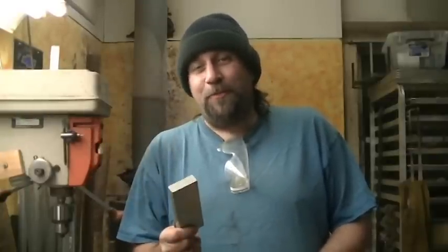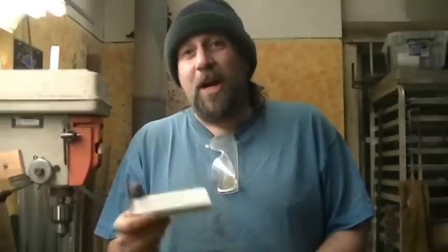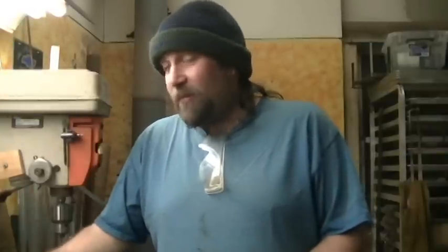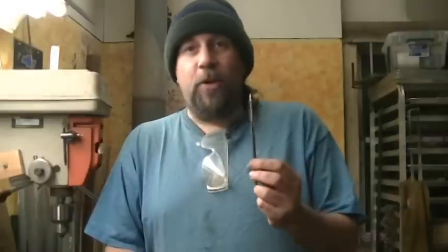What I need to do is drill a 15/16 hole into a block of aluminum that's 3/4 inch thick. I don't have a 15/16 drill bit. So what I'm going to attempt to use, and this is just out of pure necessity, because if I can't get this hole drilled, I have to stop what I'm doing for the night and then go out, find a drill bit, and start again in the morning. What I'm going to use is a paddle bit for woodworking.